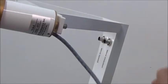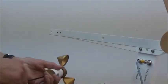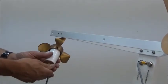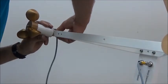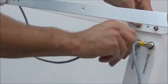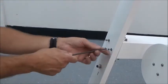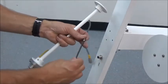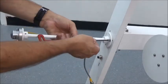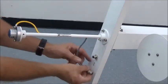These connectors work the same — you'll have the tab. Set them in, press and rotate; they're clearly marked wind direction and wind speed. Remove the screw from the base of the wind speed sensor and replace it through the bracket, then tighten it down. If you have the solar radiation sensor, remove the three screws in the center of the cross arm, put your solar sensor bracket in, tighten those down, and make the connection — it's clearly marked.